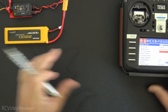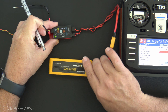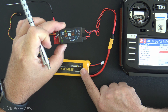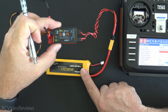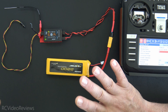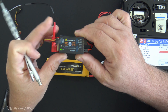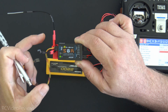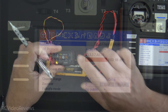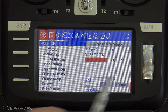I'll set the radio aside and show you that I've got a FrSky S8R — that's Sierra 8 Romeo — connected to a power source and bound to my radio. The first step is you have to bind your receiver to your radio. This video is specifically about frequency fine-tuning, not binding. You can tell mine is bound because I've got a little green LED, and on the radio you can see RSSI coming in.